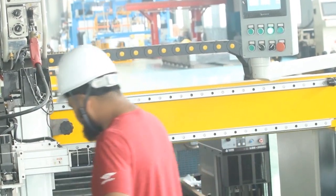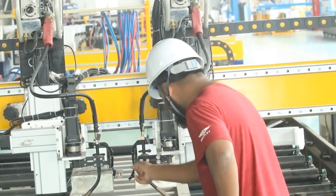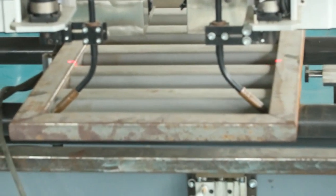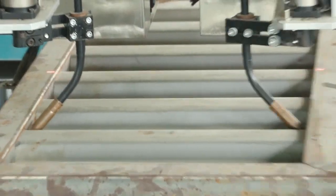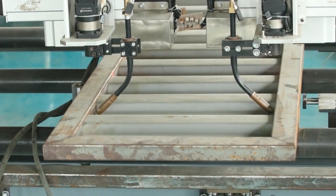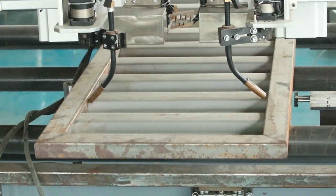It will not weld because welding is disabled. It will start to follow the scan points. You can see it is following the scanning points — the two junctions are being followed. You see, they are going through the welding motion but I'm not giving any input. That's why you're not going to see any sparking. The laser is scanning and they're moving through the weld path, but since I'm not giving any input, it is not sparking or welding.